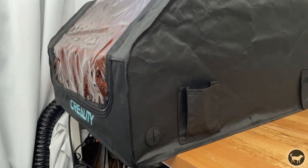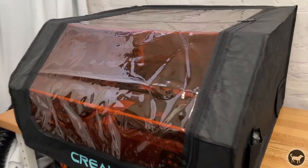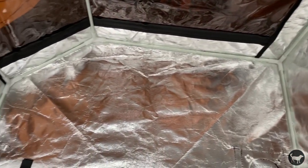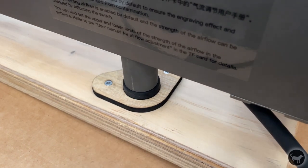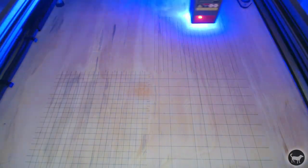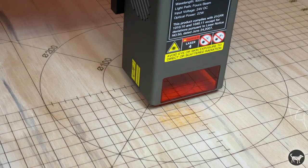Another additional item available for this machine that I used right from the beginning was an optional enclosure. This machine, like all other lasers, produces a lot of smoke, so it's great to have a way to pump that out of your workspace. Creality does sell an enclosure built of a simple plastic pole frame covered with flame-retardant material, with a zippered orange window to filter out the blue laser light. You hook up the included fan and duct hose to expel fumes outside. After the first successful cut, I attached the new feet to a spoil board and burned my grid onto it — I use this so I can tell exactly where my laser is going to burn and ensure everything is squared. You don't want to start burning a long image only to find out the wood was crooked. You can find the files for this grid and feet in the video description.